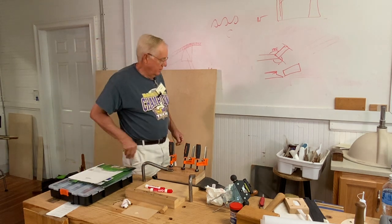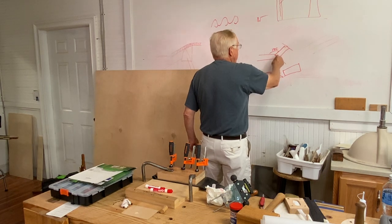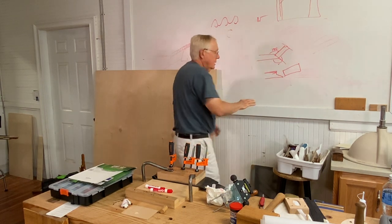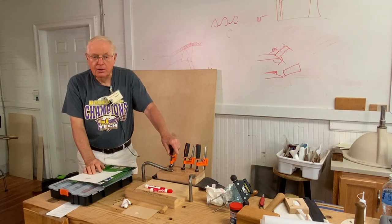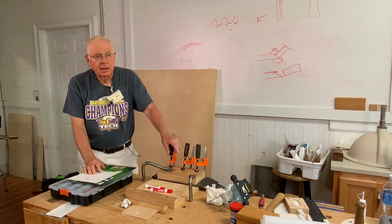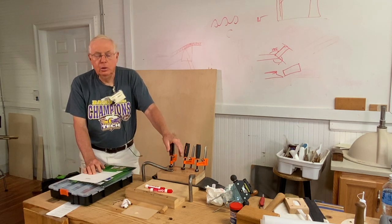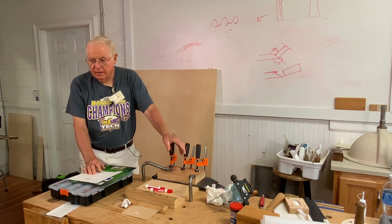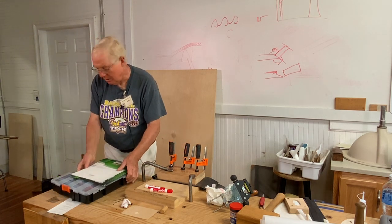So the other side of this would have a bird's mouth joint on it. So you've got a square, bird's mouth, square, and it all just fits right together. And that was for an eight-sided box. They also make a cutter for a 12-sided, and you can use this one, I think, for a 16-sided box. Coopers use them, and all of the router bit companies sell them. They're readily available.